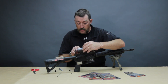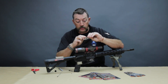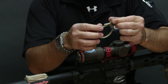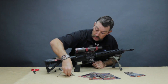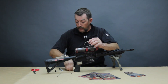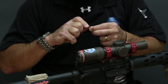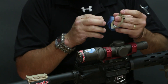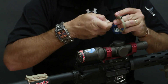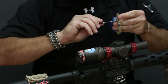I like this fit, so I'm going to go ahead and take this off and push the strap into the slot on the lever. It's going to start pretty easy and you'll be able to get most of the way in, but the last little bit is going to be pretty stiff. Put it with the strap side down, press down hard, and it should be flush. Now we can insert the small retainer screw in the hole — there's a little tiny hole right here and we can go ahead and screw it all the way down.